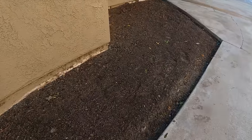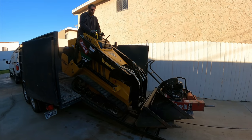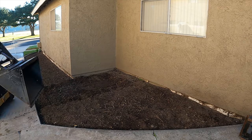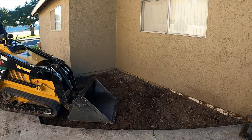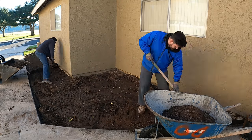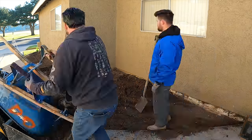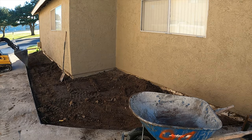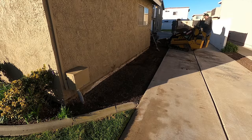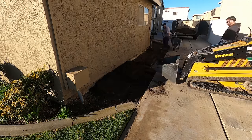There were a bunch of bushes in here that initially made a narrow entrance to the driveway. Since I have the Vermeer three-foot-wide skid steer I'm going to use it, though you really could hand-dig this — there's not a whole lot of dirt. I took out about a yard and a half of material. Most of it was pretty soft because of the bushes. I just touched the hard pack below the topsoil, which is exactly what you want — all the loose material out so you're sitting on something tight.